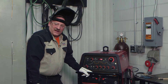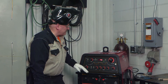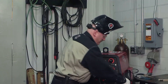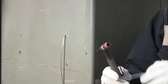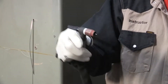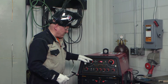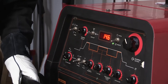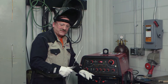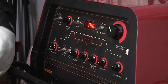I'm going to be welding today with a Precision TIG 375 — that's a pretty high amp machine, probably a little more than what I need, but that's what's available today. I have a bottle of straight argon, running my flow rate at about 20 cubic feet per hour for aluminum welding. I'll be using a number 20 torch with a gas lens collet body and a number 7 nozzle. I have an intermediate back cap so I can get inside the oil pan we're working on. I'm using a 3/32nds tungsten. My starting current is set for about 14 amps, and I have my current set on remote control, which is important with aluminum welding — that means I can vary the current as I'm going. As this piece warms up, I can back off my amperage. Right now I have the top current set at 146 amps.